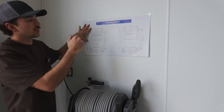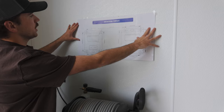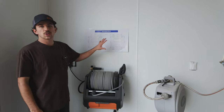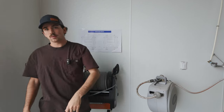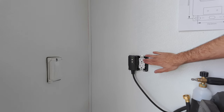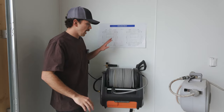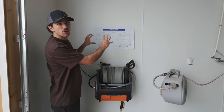I have my laser set up with a perfectly level red line and my center point mounted, so we're just going to hang this up here. Because there's a bunch of wood blocking behind here, I can use any of these screws and mount it. This is the FRP installed — we did it eight feet up — and you can see we have some weatherproof covers. I ordered another weatherproof cover for this two-gang outlet from the manufacturer so it'll have a matching cover. That way if we want to pressure wash this whole wall we can wash it all off, even with the outlets. Let's grab a drill bit, pre-drill all these, then grab the impact and lag bolts and mount both brackets.